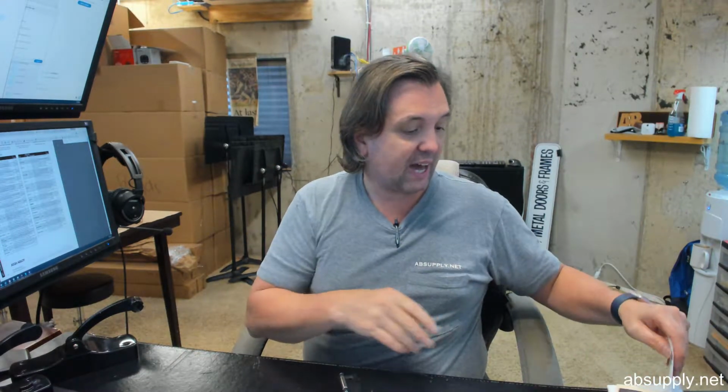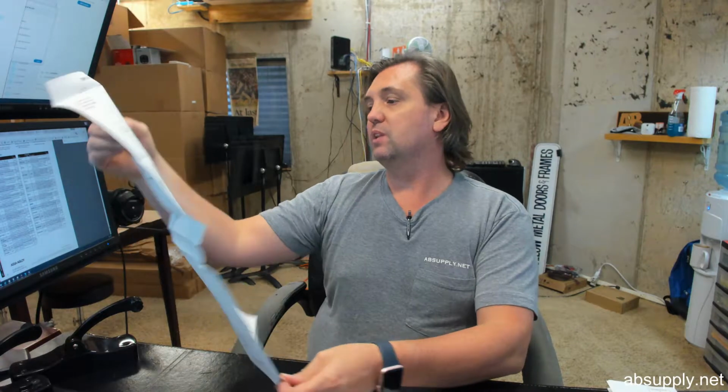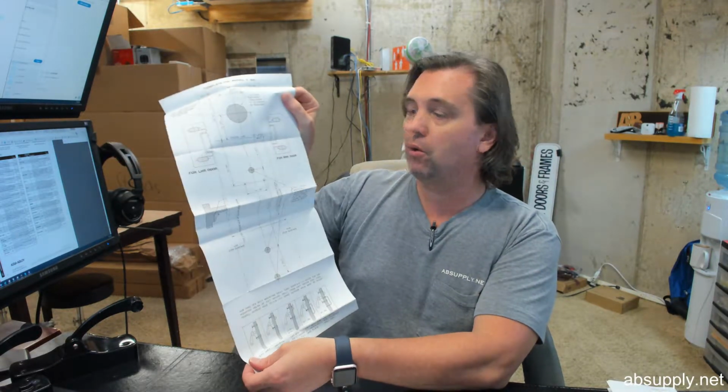Now the rest of page 1 of the installation instructions we've covered. Locating the center line. What they're saying is the center line of the door would be 2 3/4 back, but they've got a template here for your review. And this will, again, accommodate. They've got a template if you're doing a thumb piece trim, is my guess. Sure. With an exterior pull handle. The other side of the template is just that 2 1/8 inch hole. And while it will accommodate,